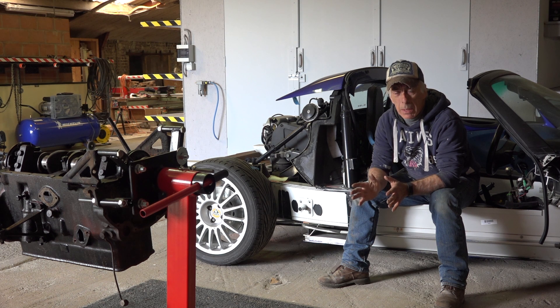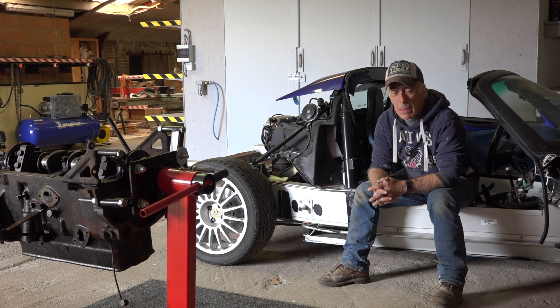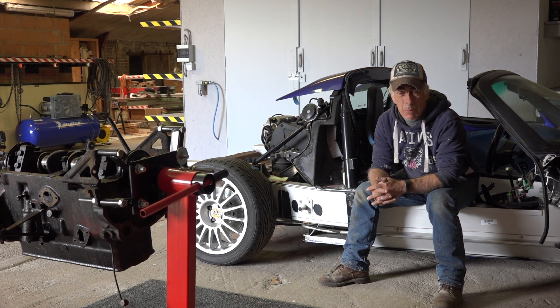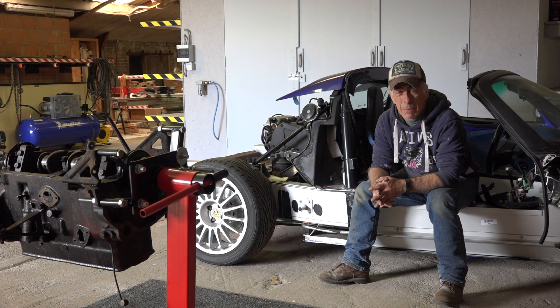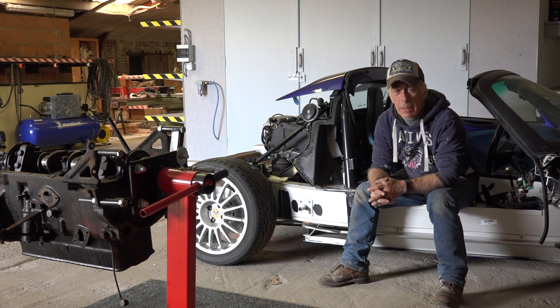The final question is: is it worth the money to build your own paint booth? I think it is, because I have paint jobs to do on my projects regularly and I want the paint booth handy and available. The total cost was around 2,400 euros, or about 2,600 US dollars. The most expensive parts were the two fans, which added up to around 700 euros for the two together, and the heating elements were another 700 euros. The lights were not too bad. I don't count labor because it's one of my hobbies, but it is a 10-day job to build a paint booth like this one.